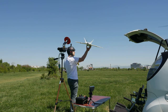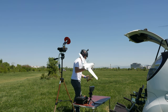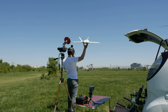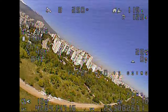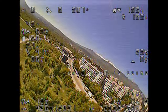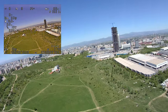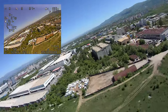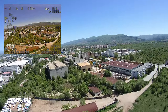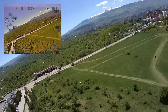As you already saw, the beginning of this plane's flight journey was not ideal by far, but after the last incident I had now sorted out all issues, glued whatever needed gluing, and was confident things were going to go well this time around — and they did. Perfect takeoff in auto mode, just because it can. I also increased the banking angles so turning the plane in FlyByWire A mode no longer had a radius of 1km. I pointed the plane up and throttled up to gain altitude for the standard stall test and — imagine my surprise — not only did it not stall, it didn't even turn, just kept going straight with a very slight turn from the trim, shaking for an instant then leveling out. Pretty impressive compared to other models.